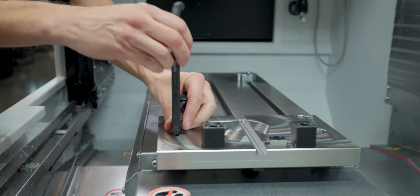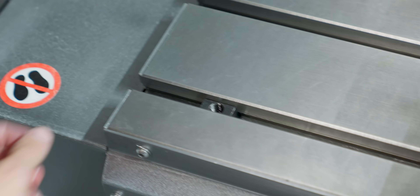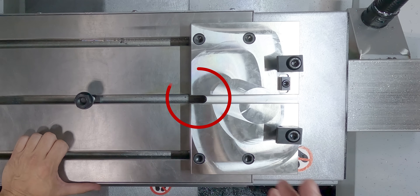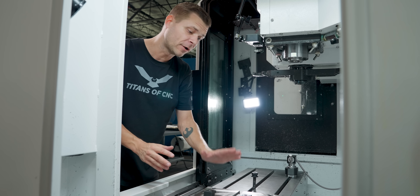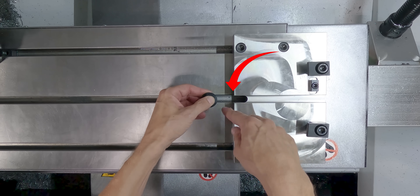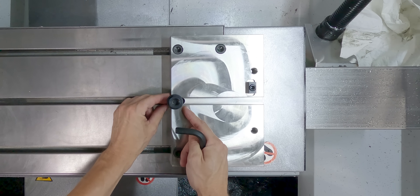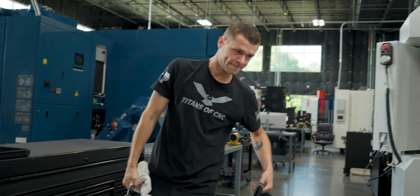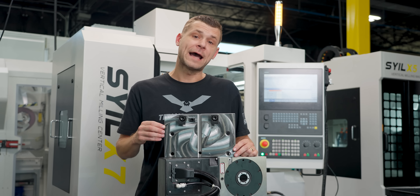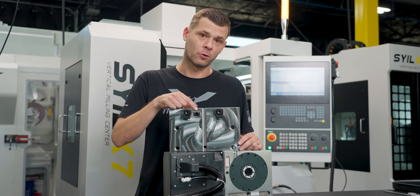With these four large counter bores, we're going to be using M12 screws going through the T-slots in our table to secure the plate. You might have noticed we originally had three holes for holding down our rotary axis, but to add more downward force at the center of the plate, we're now holding down straight through the center with a slot instead of a hole — going right down through the plate to the T-slot in the table. The large slot in the middle is used for alignment and lines up with the keyway slots in the rotary axis, and the small keyway on the edge serves as a bump stop in X for our rotary axis.